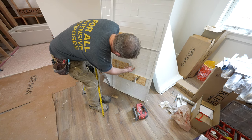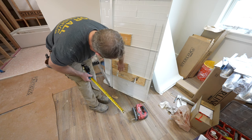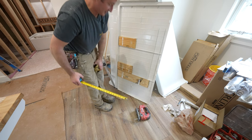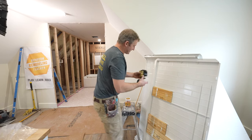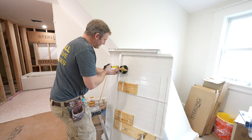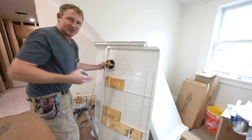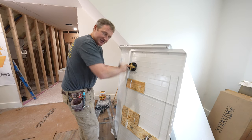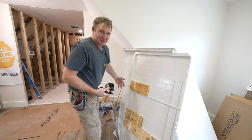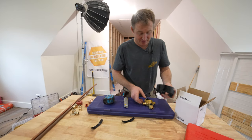I'm going to go about four and a half inches off the tub deck for the tub spout, and 18 inches from center to center for the valve — that'll put us right in the center of this kind of fake tile pattern on the panel. They have support blocking for grab bars, so make sure you don't interfere with that. The ultimate thing is that we're going to be sticking this straight up against the back wall, measuring from where your studs are going to be. You want to be back one and three-quarter inches, so we're going to make sure we have some blocking one and three-quarter inches behind the studs so the valve mounts nice and flush with the background.